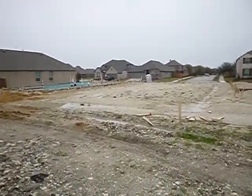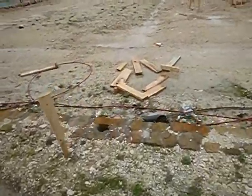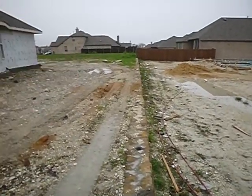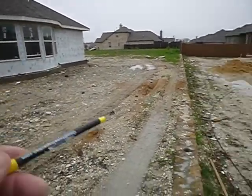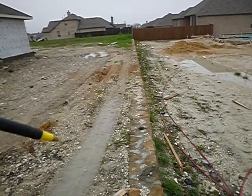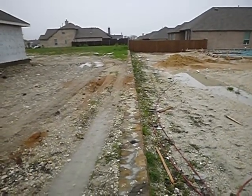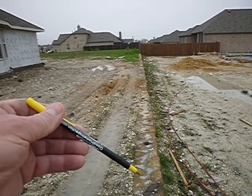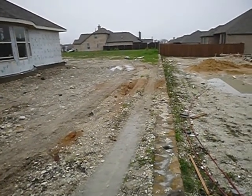There's a little retaining wall over here. It's probably the community's — it probably doesn't even belong to the homeowner. It's good to know: if this wall is farther away from the structure than twice its height, then in theory it should never affect the foundation. It probably never will affect the foundation. It's also the 45-degree angle — if it's 45 degrees from its base and anything beyond that 45 degrees, it shouldn't affect the foundation.